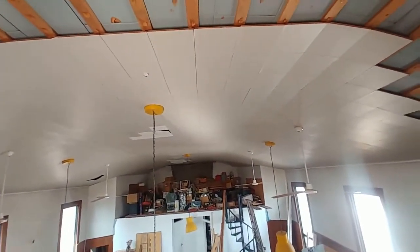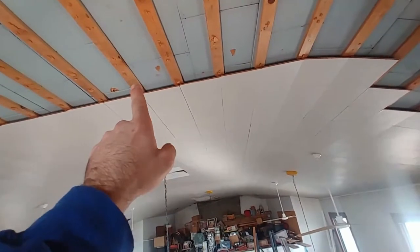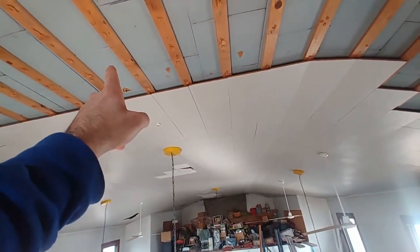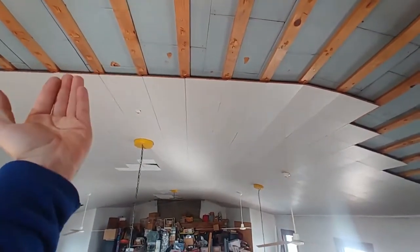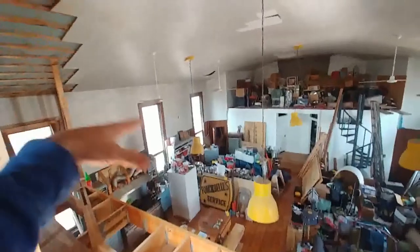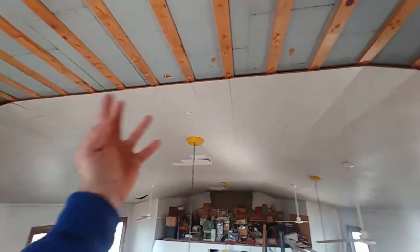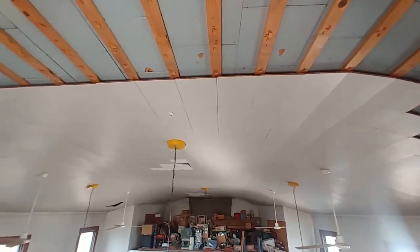And so I think we're going to take the sound tile down, but we're going to leave the furring strip and the previously existing ceiling up. And that'll be what the top plate is actually up and touching. I can't see the merit in working out above this height without Baker scaffold or anything else and trying to cut that all out and rebuild and block the rafter system from below.